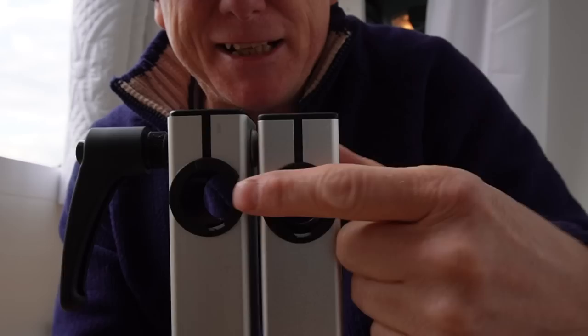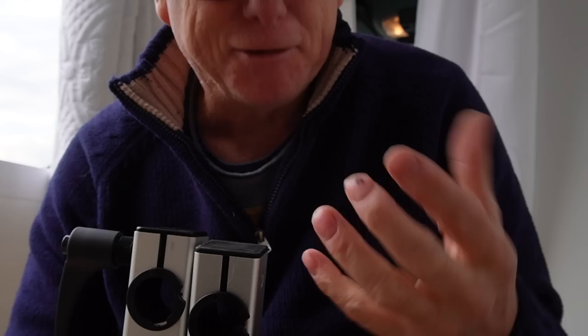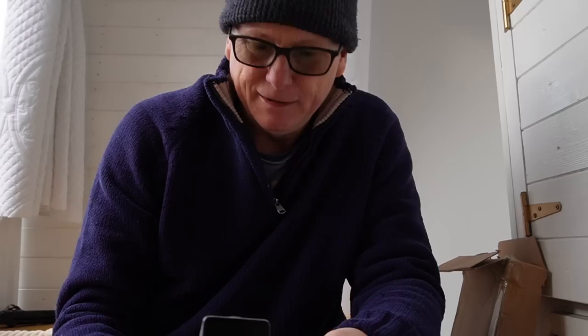I may be nitpicking, but you can actually see a difference in the moldings. These little tiny round circles are made by the ejector pins — when the molding is inside the mold, ejector pins push it out. By looking at those I can tell these were definitely made from different molds, so they are made in different factories. I can confirm that just by looking at the plastic moldings. The aluminium is different as well.